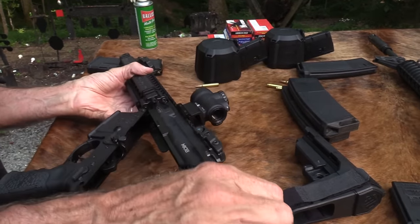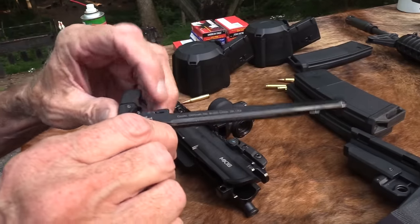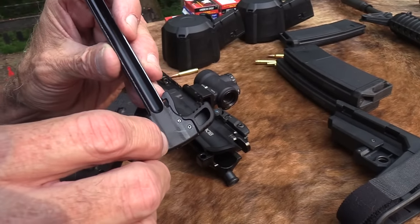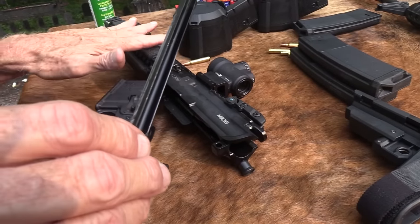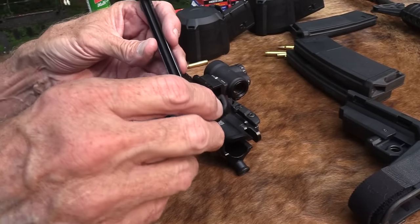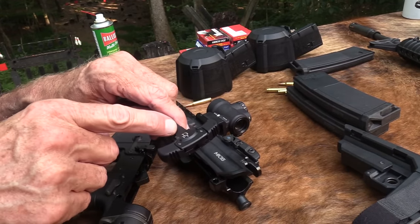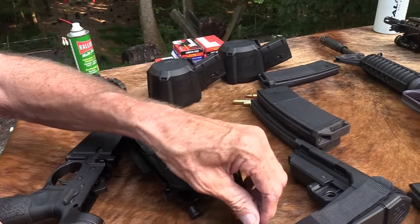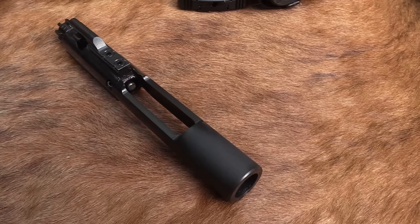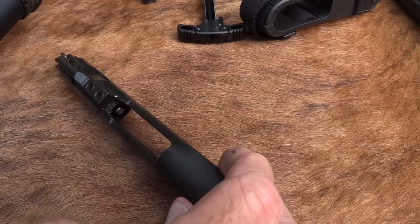Let me take it apart — it's probably nice and hot now. This is what they call the grip-and-rip: the Daniel Defense version of the charging handle. It actually takes some of the gas — it's designed to vent gas off a little bit, because you do have more of a gas issue, especially running a suppressor. It blocks some gas from coming into your face and redirects it to the side. And of course you can see the staking on the gas key. Everything is magnetic particle tested and pressure tested — that goes without saying with Daniel Defense. You've got an M16-style bolt, all tested thoroughly.